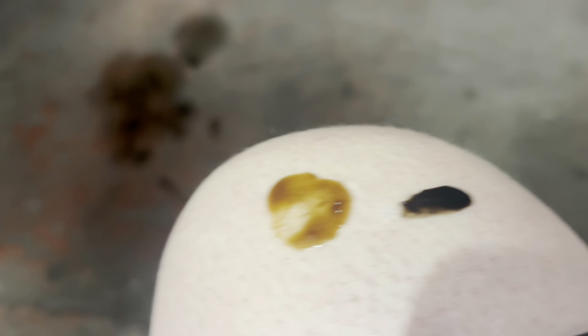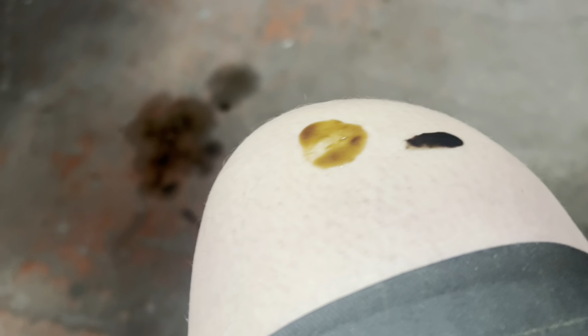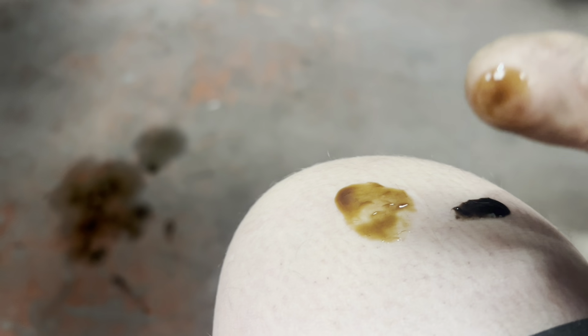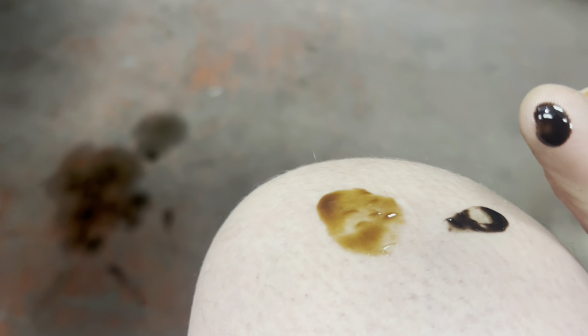There, 399. We have oil leaking, is what they said. So we'll just compare it to engine oil. I'll put a bit on there and see what that looks like. I'll have a dip of that and put that. Definitely different oil. That's engine oil. That's what's coming out the back. Totally different colour. So it's not crankshaft seals there.